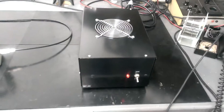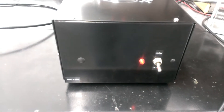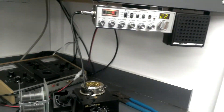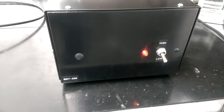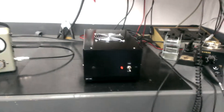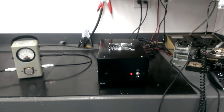So there you go folks, that's just a comparison — the dual 2879s with the regulated power supply versus this one, which is two 2879s with an unregulated power supply. We're only kicking it with a Cobra 29; you could probably kick this thing with an X-Port and see quite a few more watts out of it. But this box makes an excellent driver — excellent, excellent — for the dual 35Bs. Hope you enjoyed, 73s.